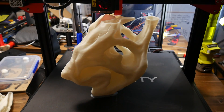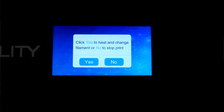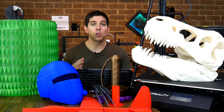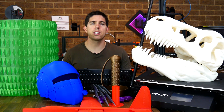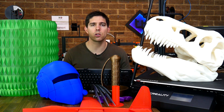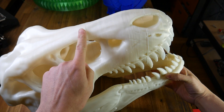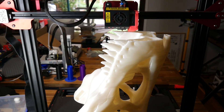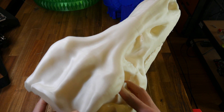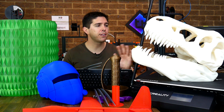When printing the top half, due to the size of the thing, I had to use filament runout detection twice. It worked fairly well, but the steppers are not locked in when you're doing the change, so make sure you don't bump anything or you'll introduce layer shifts. It's also worth noting that the bed does cool down while it's waiting for you to change the filament, and therefore I wouldn't recommend changing this surface to glass or anything else that self-releases once it's cool. The final result is absolutely epic from afar, but suffers from some banding up close. My slicer change of 1mm of Z-hop makes sure that the nozzle doesn't knock any parts loose, but it's not ideal in avoiding banding on the vertical surfaces.